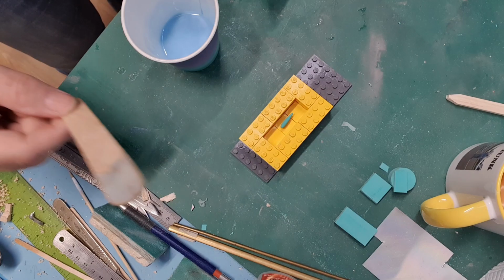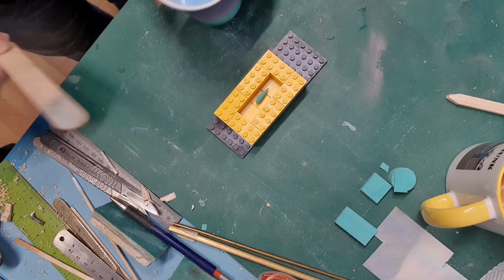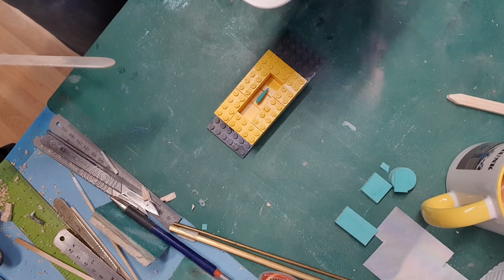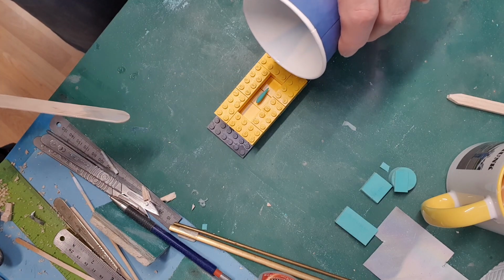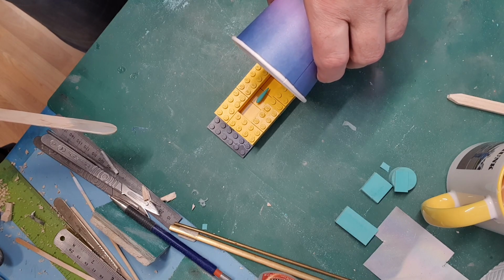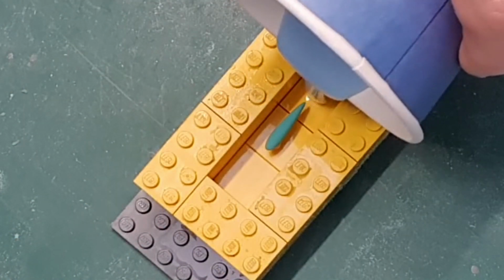So now the RTV has been what's called degassed. We've now got to try and hope that I've poured enough that I can fill this mould. Now the trick to not getting any more air back in there again is to fill from the bottom up. So you need a thin stream of RTV into the bottom of the mould, and then you need to gradually fill the base up and let it climb up the sides and over the part gradually.